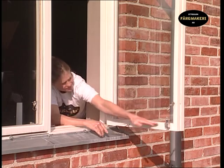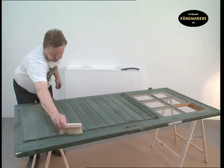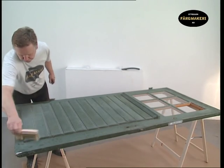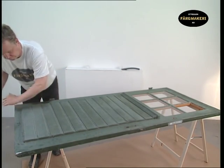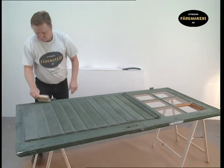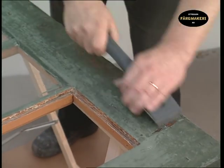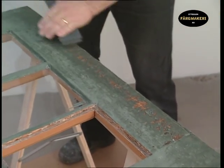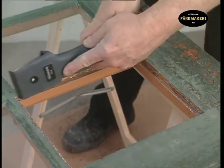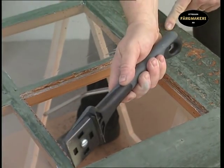Make sure that you have good ventilation in the room you're painting in, especially for drying purposes. A door in this condition can be renovated at various levels. Since it is a basement door of a holiday home, we have chosen a treatment that will retain the patina — we're not looking for a finish that is as good as new. Brush off all loose material and scrape off any old paint that is loose, and remove any old putty residue from the window frame.